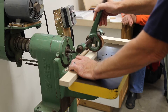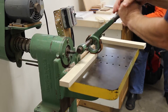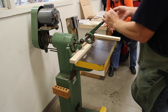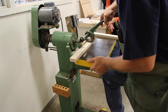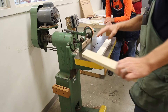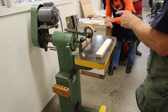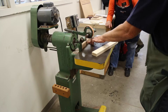This leather gives it a good grip. I'm going to hold it in position and turn on the machine. I don't want to just push the foot pedal all the way down to the floor because I need to give the machine an opportunity to eject the chips. So I'm going to sneak up on it a little bit — try a little bit. Now because the drill bit is safely behind the fence, unless I do something silly, it's going to be really difficult to injure myself. I don't have to turn it off to reposition the piece.